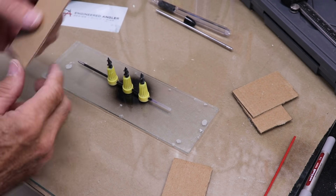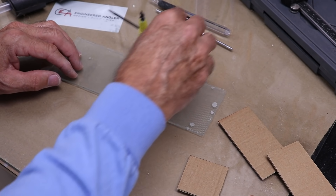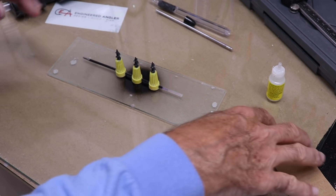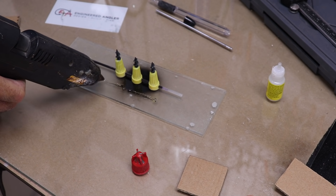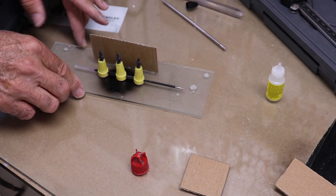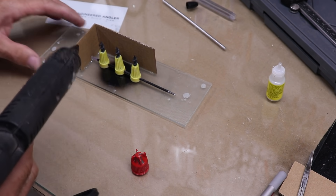By now you may have figured out I'm doing a one-part mold, not a two-part mold. I take the pieces cut to length and hot glue them down. I first glue the master piece down to the glass with crazy glue — a very temporary bond since it's glass — then run a line of hot glue and set the first side piece in it, eyeballing it. Everything else settles in accordance to that first piece until the whole thing is put together and sealed.